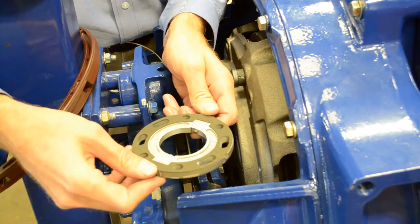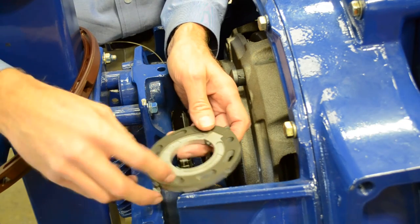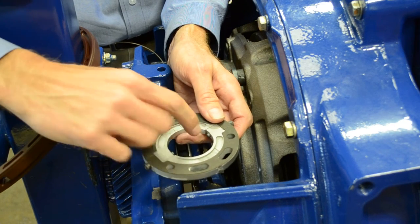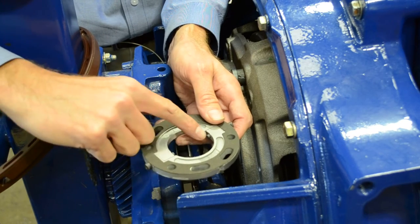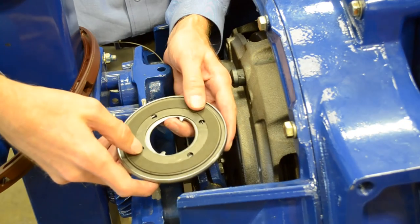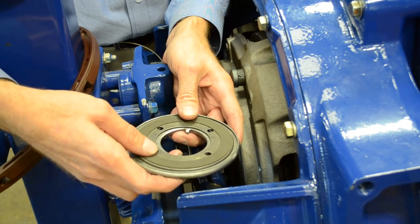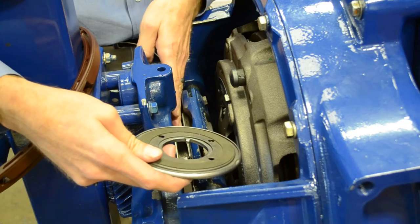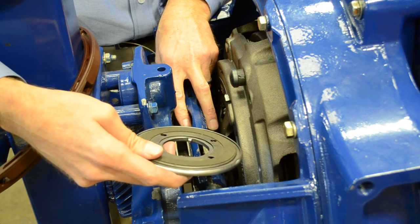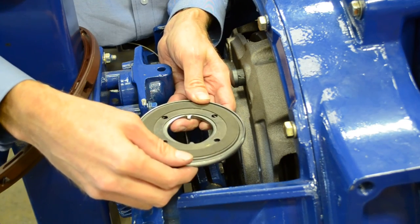The two piece has no limited slip. These are typically put into place when the single pieces have failed or worn out. But if the driver hits the clutch brake too hard with a two piece clutch brake, that can either break the clutch brake completely or break the screw heads off that are retaining it to the input shaft. If you do have a single piece clutch brake that fails and needs to be replaced, we highly recommend you do not use a torch to cut it out. Excessive heat can cause the input shaft to become weak and break over time. There is also a plastic retainer inside the release bearing for grease dispersion that you can melt. We recommend using an air chisel on either side of the single piece to get it out of the way.